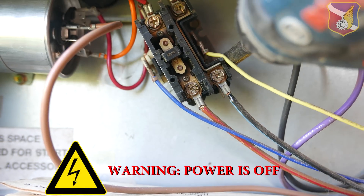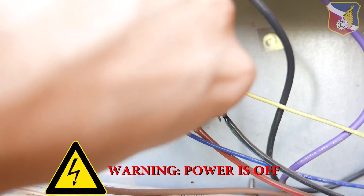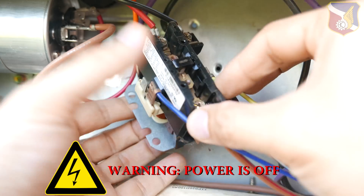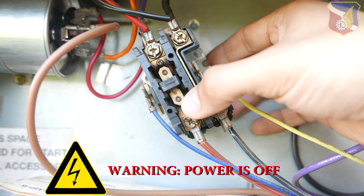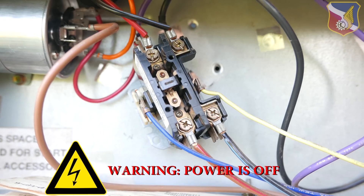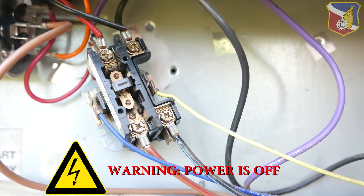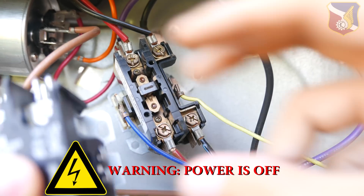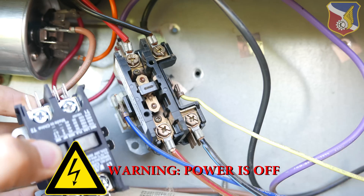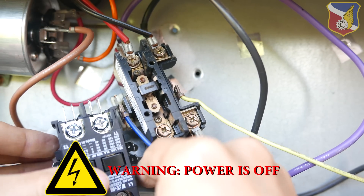First, let's remove the screws that hold the contactor inside. After we remove it, this one is pretty nice — it shows the coil right there. Now we're going to match this up. The bottom two wires — if we follow the red and black — you can see they go all the way outside to the unit where the breaker is. So those will be our line one and line two, and we want to connect them back to L1 and L2. The other side is T1 and T2. We're just going to move wires from one side to the other, one by one.